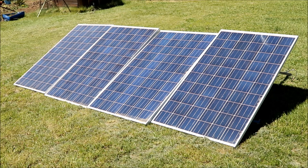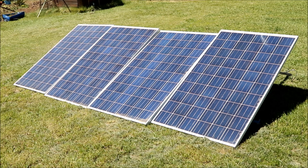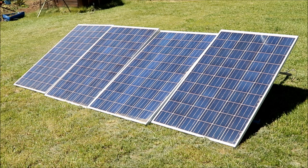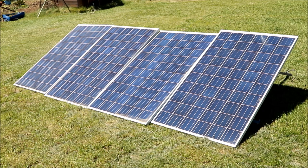As you can see I've got four solar panels here. They're actually 250 watt. For some reason everything I've seen online, Americans seem to have some fascination with piddly little 100 watt panels. I have looked - you can get bigger ones - but I've got 250s. They're a kind of smallish standard here now. The output of these panels is about 40 volts - 39 point something volts open circuit, which means unloaded - and they have a VMP, which is their maximum power output, of about 31 volts. I've got these four connected in series, which means one daisy chained to the other, and I'm getting about 131 volts out of them open circuit at the moment.